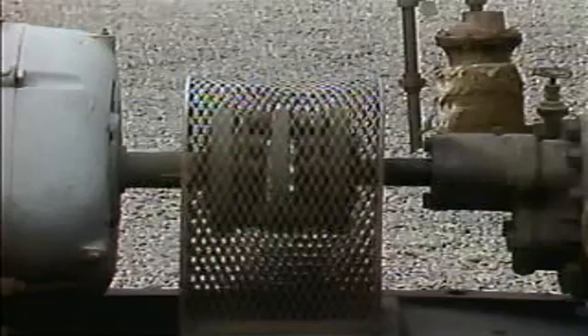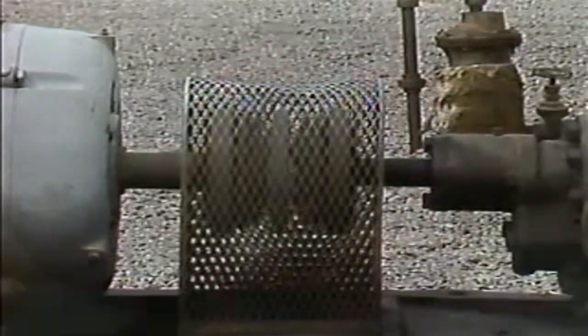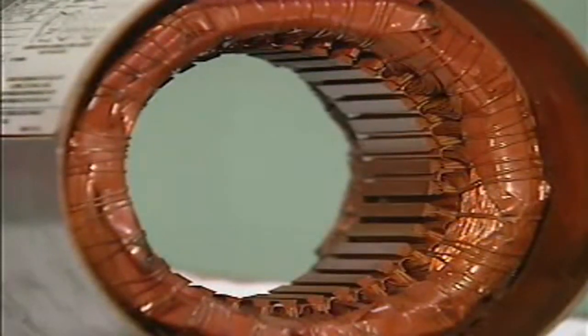The last type of low voltage protection we'll look at is a low voltage or LV relay. An LV relay is an electromagnetic switch that has an operating coil which becomes an electromagnet when current flows through it. When a typical AC motor is first started, current is three to five times higher than the motor's normal operating current. This surge of current could trip the power supply and in some cases may damage the motor's windings or the cables leading to the motor. In this part, we'll look at a reduced voltage start AC motor controller that can protect a motor against these current surges.